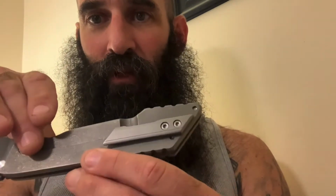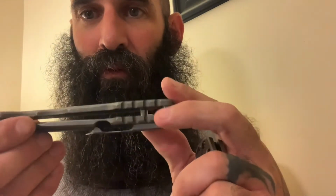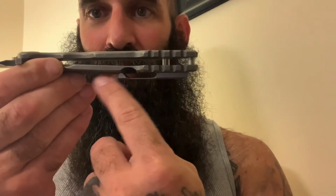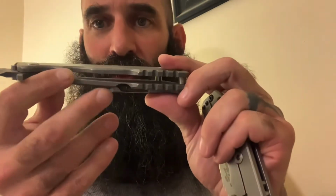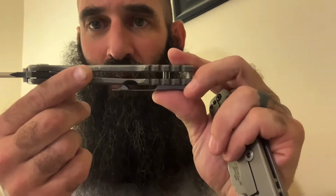Then I straightened the vise back up, swept it back in, and then I did the same thing here. Basically decked it, and then corner round, and then I cut it off, had it sitting in the vise like this, went through here with a bull mill to rough it, both sides, and then took a ball and kind of finished it up into that point, and into this point, and then this point. And then after I did that, it wasn't smooth enough to go in and out of the pocket, so I had to kind of blend it a little bit, and I did most of that by hand.